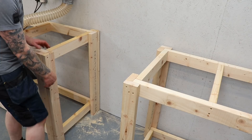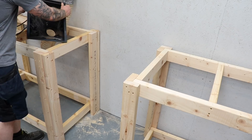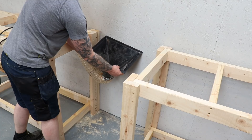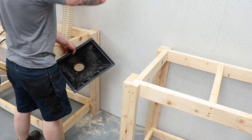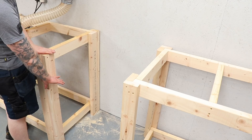This is the space for my miter saw to sit in - just a nice simple frame. I'm going to screw some four by twos here and here, level them across. I have to fit the cowl in - I'll probably lengthen the flexible hose and sit it in the middle at the back of the frame to capture dust. I also want to get my shop vac hose up into the back of the miter saw, and I might build a cabinet around it. First I'll build the frame.